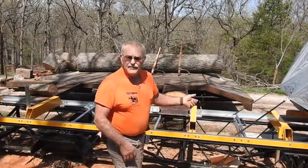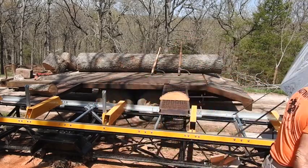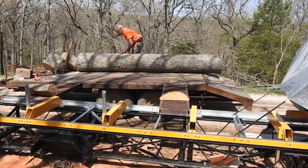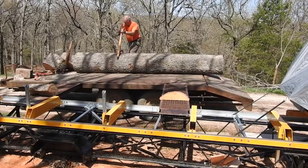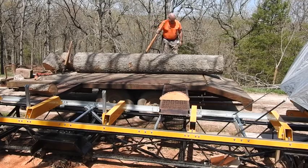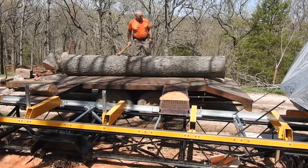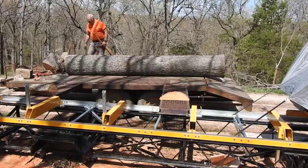It's not looking too bad as far as the height of the deck in relation to the height of the trailer - they're working out real well, just a little bit of a decline. My skid loader is still broken down and my little tractor does not have enough capacity to lift and carry this log. It was going to be much longer until I realized I had to cut the bad stuff off both ends, but I ended up with roughly 12 foot 8 inches in length and roughly 18 inches in diameter. My nice big 23 inch log got small really quickly, but that thing still is essentially 1,264 pounds.